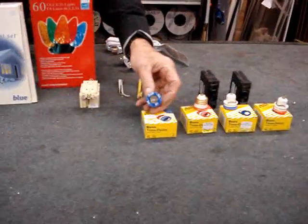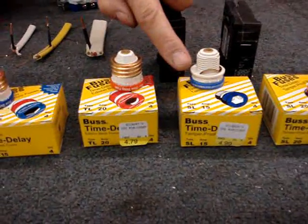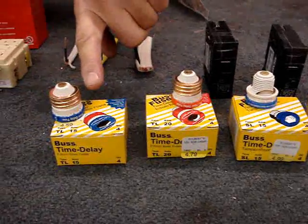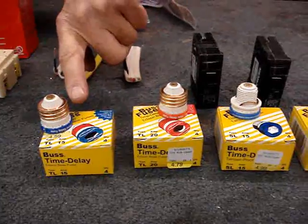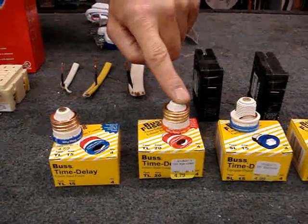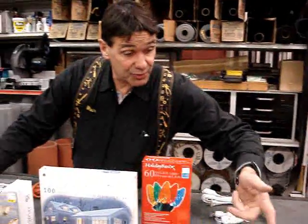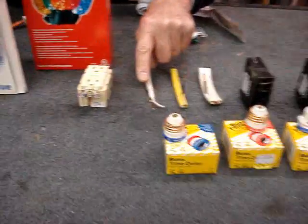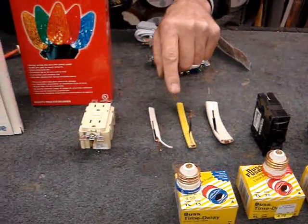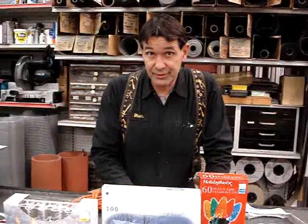When you plug into a wall outlet, your wall outlet is typically going to be on a 15-amp fuse — a smaller but same-value 15-amp fusetron. This is an SL fuse with a small base; this is a fuse with a large base, same size as a light bulb. These old fuses were the same size, so people could incorrectly put a 20-amp or even larger fuse into a 15-amp hole, losing the protection the fuse is supposed to provide. Most homes wired in the 50s are all 14-gauge wire, so your house is typically fed with only a 15-amp breaker or fuse, giving you only 1725 watts.